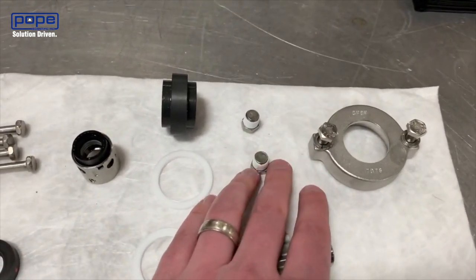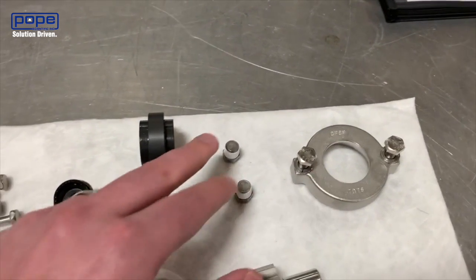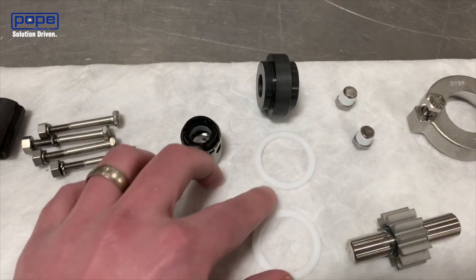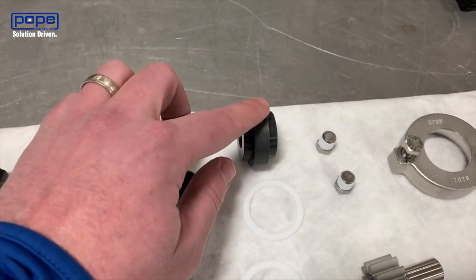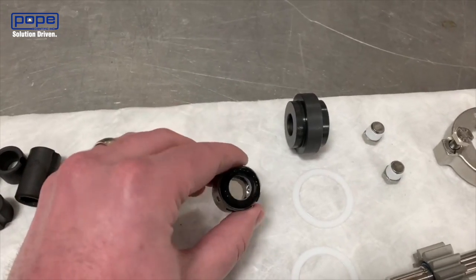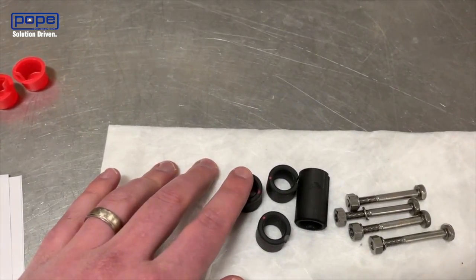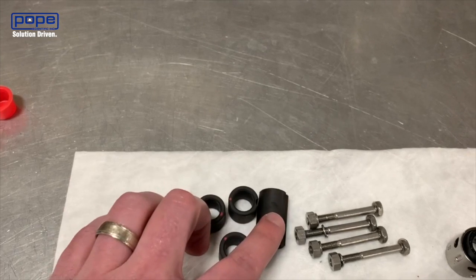After that, we're going to your gland plate — your gland plate is right here. You've then got some bolts that act as plugs. You then have the gaskets for your seal seat, and your seal seat is right here. We then have the actual mechanical seal. We've got the housing bolts. And finally, we've got a total of three short bearings and one long bearing.